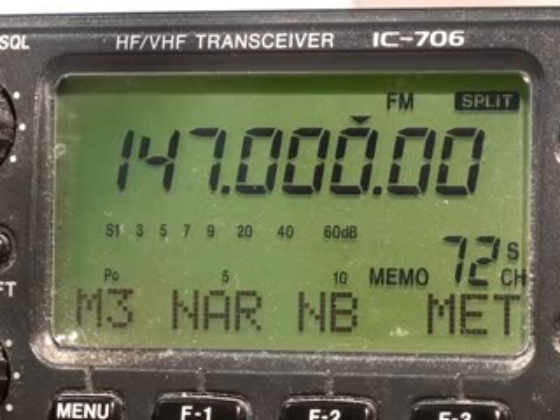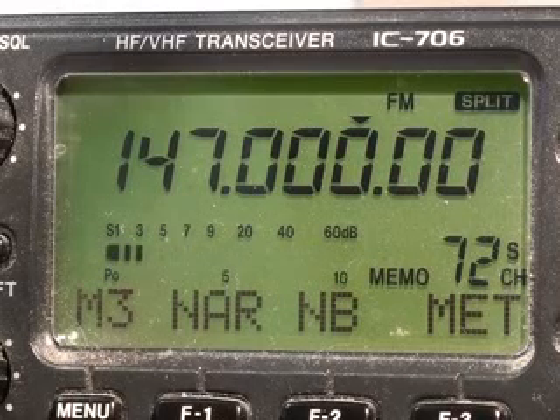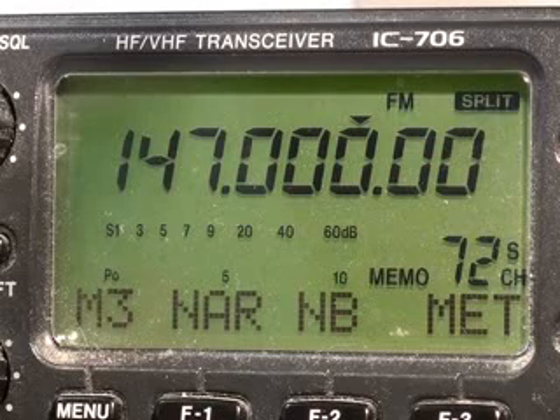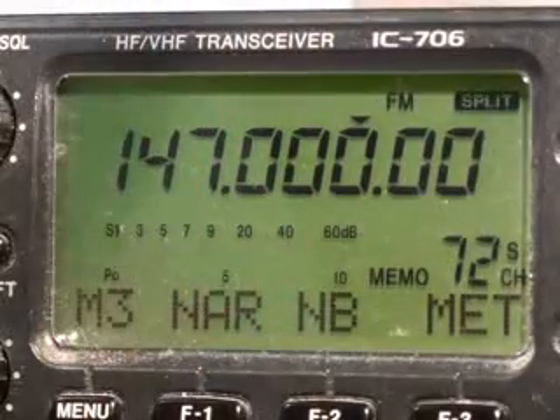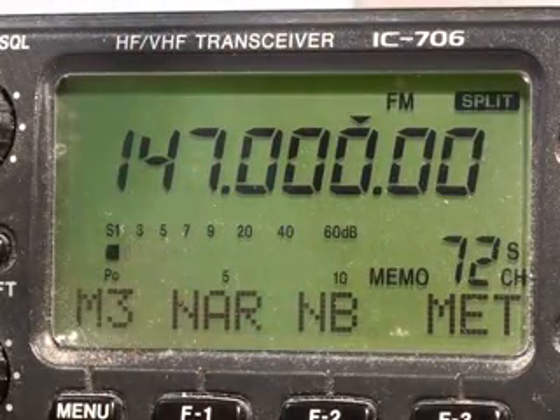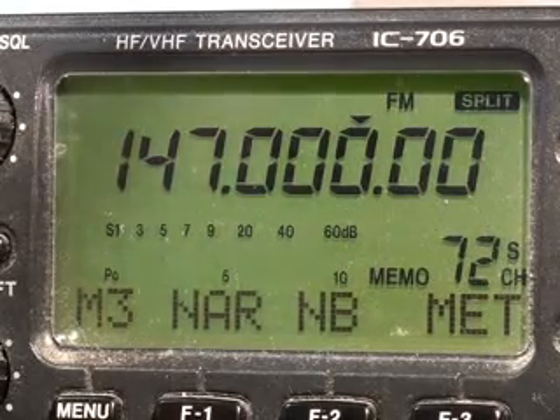Here I've switched the IC706 to the FM mode with the squelch on. You'll see the noise come up — opening the squelch, come up again, squelch dropping off at the null. That's the X-control and the R-control. So you can use a signal strength meter on FM, but you can't hear any tone.